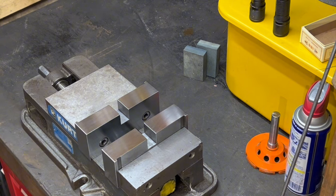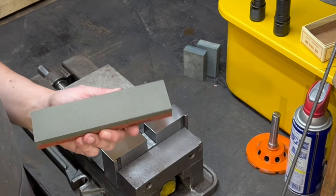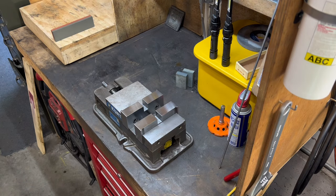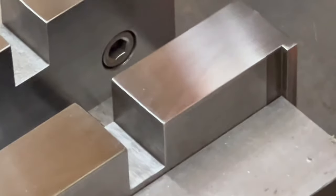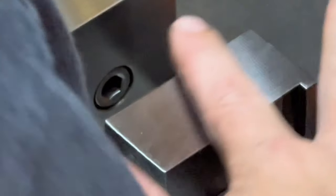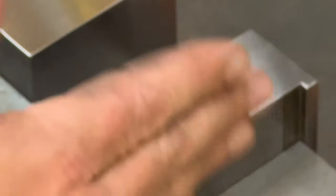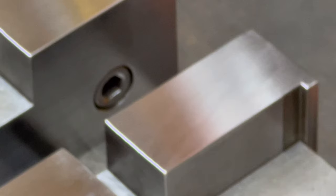But one of the tests of a machine shop stone is that you can rub it on something flat and you won't damage the surface. So let's start with that test here. Let's get us zoomed in so we can see that. So this surface is very consistent. It has some finish marks that go north and south, but there's no dings or scratches in it. And there's a teeny bit of pitting down here, but nothing.